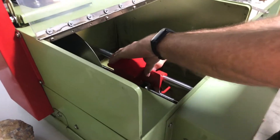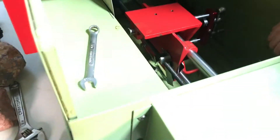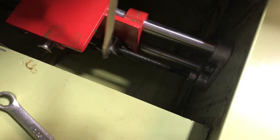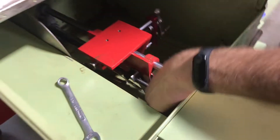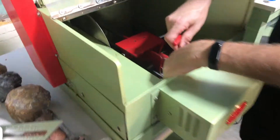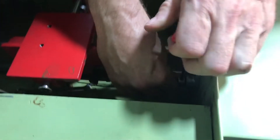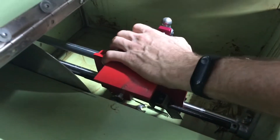I can feel that little click-click-click-click front to back. What you can see underneath here is in that lock collar, there's a little bit of space. What I need to do is bring that lock collar in a little bit. I am going to momentarily turn on the saw so I can move the lock collar to the top, loosen it, make sure I'm on the flat, tighten it back up — and that's going to eliminate that front-to-back motion.